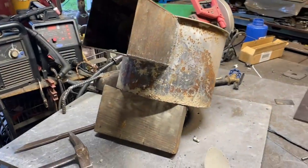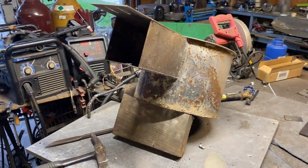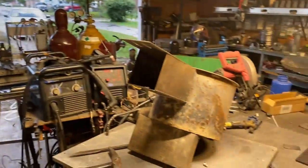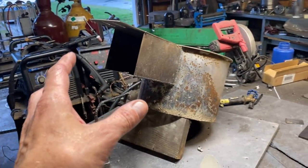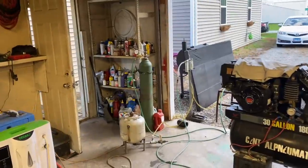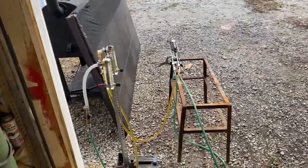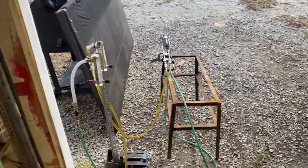We're going to dump excess fuel into this foundry furnace that I'm repairing, and after it's been running for about 15 minutes to get the items in the crucible up to temperature, we'll then hit it with a quick surge of oxygen at the last moment to initiate the melt. We're not going to be running this thing on oxygen the whole time — that is not the strategy I'm attempting to deploy here. So don't beat me up in the comments thinking this is just going to be too expensive to be practical — it may be, but if you've got to melt some camshafts down, sometimes you've got to get a little bit more sophisticated than the average setup.